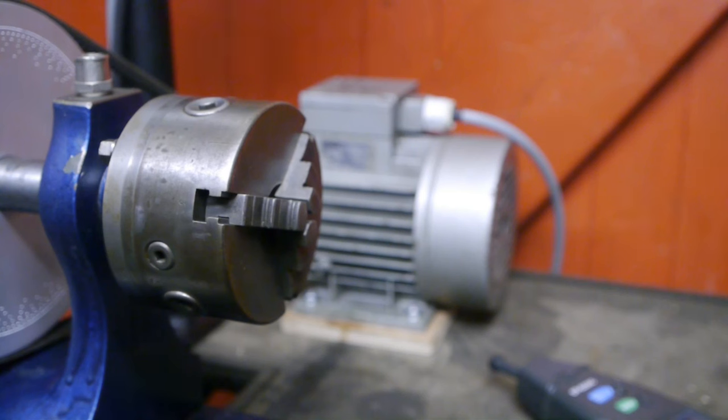At about 70 Hz the motor starts vibrating, and you can really hear that. It's probably an unbalance, but it might also be the bearings working themselves loose again in the housing. Not sure. Nothing I can do about this for now, but I guess I will start looking for a better motor.